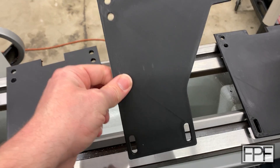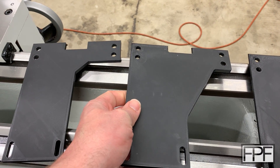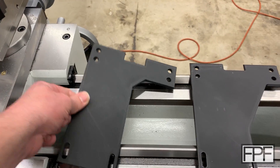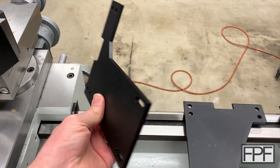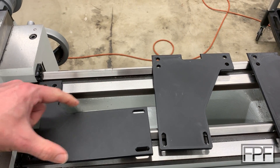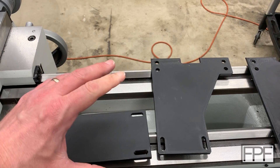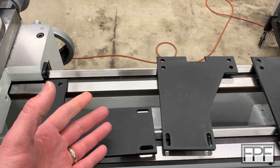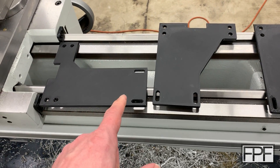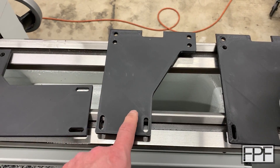The second one was pretty close, and you can see I adjusted the design of the side because I started to get a little nervous that even out of aluminum this part might not be stiff enough. When I tested with this one by actually mounting it up, what I was noticing was that even though flexing along one axis doesn't make a big deal, what was happening was it was twisting. The part was twisting from end to end, causing about ten thou of change in the reading on the DRO scale. Ten thou might not sound like much, but that is a mile in machining — that is way off. So I adjusted it to be a lot thicker until we neck down to the bottom.